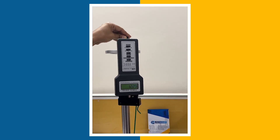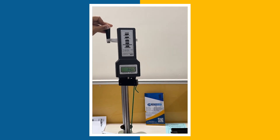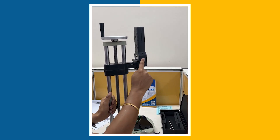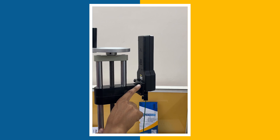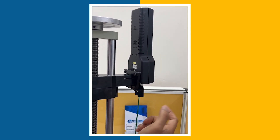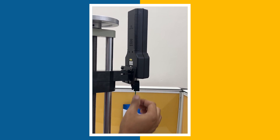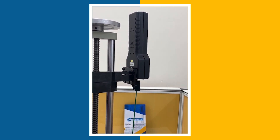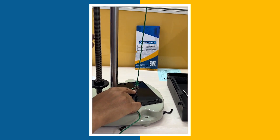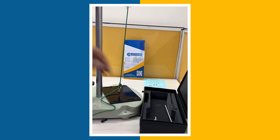This is how I am applying the force and getting the value on this force gauge. The force gauge has been fitted at the back with the help of a hex key, and the wedge grip is also connected to the force gauge to give proper support to the subject so that it does not slip out. At the bottom you have a hook option — you may have different options to ensure that the wire is correctly tied.